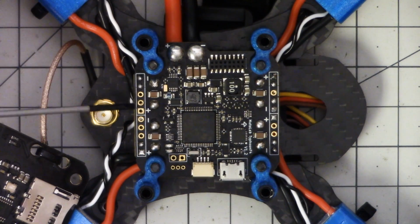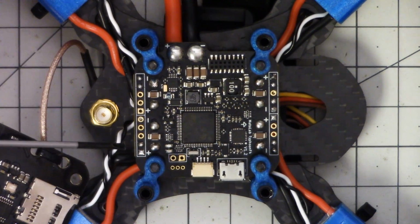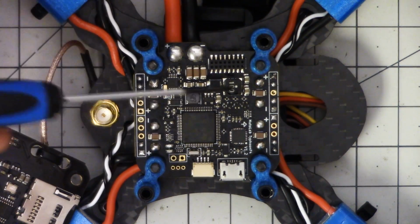And you can imagine that it would be really easy to sort of accidentally get one of these wrong. So just be real careful as you solder it up. Make sure you're looking at the board the right side up. You're not looking at the pinout diagram for the bottom side instead of the top side. And just make sure you solder everything where it needs to go.